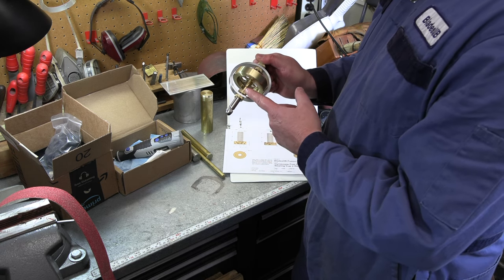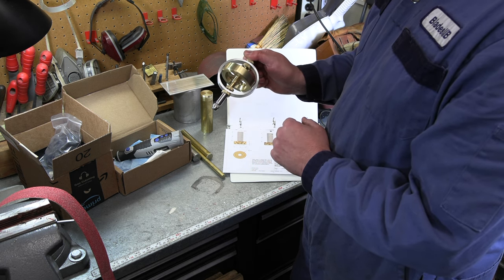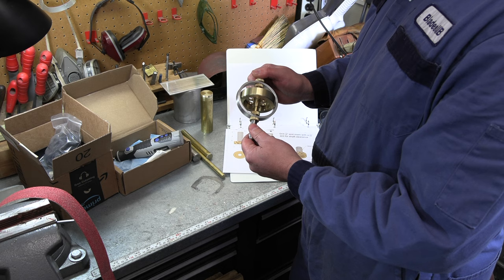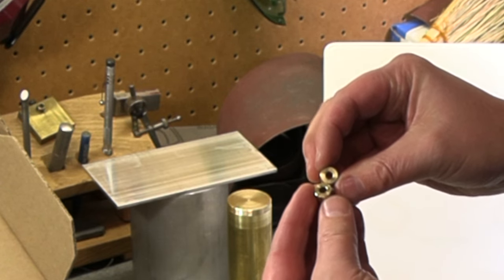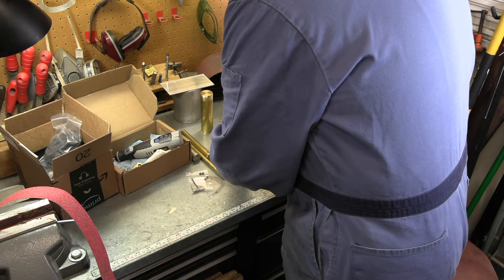And I'm just gonna throw these back in a collet, cut some relief on the backside of those, reassemble it, and let's see where we end up. All right, we'll see you back here in a minute and see if we found our issue. So, you can clearly see I've got little rub marks on the inside of these bushings, so they're rubbing on that bearing a little bit.